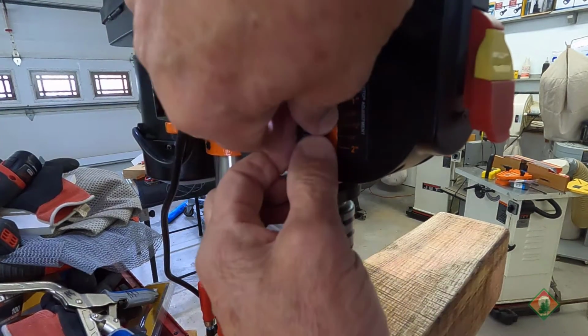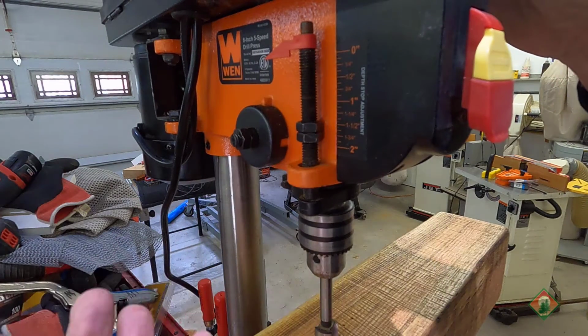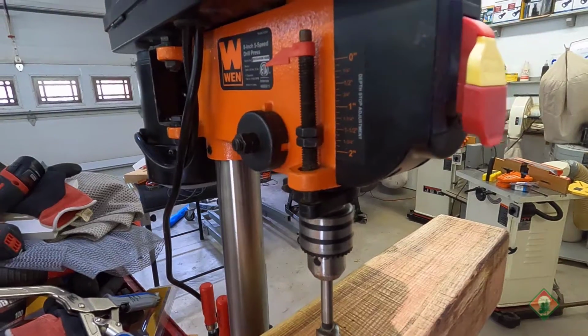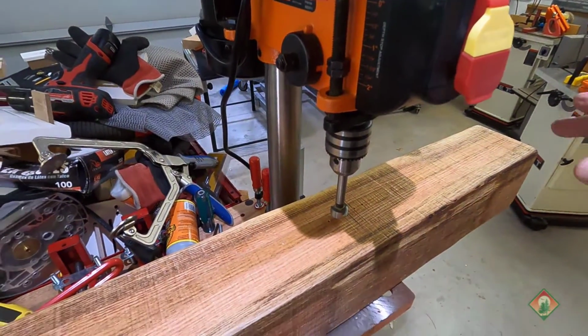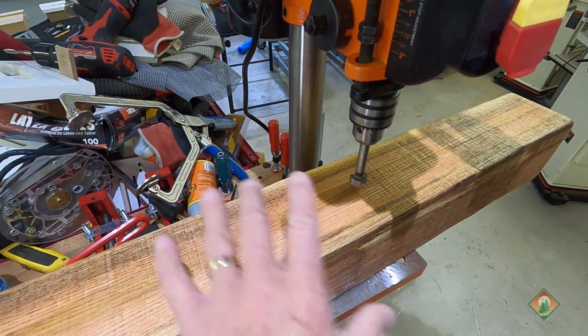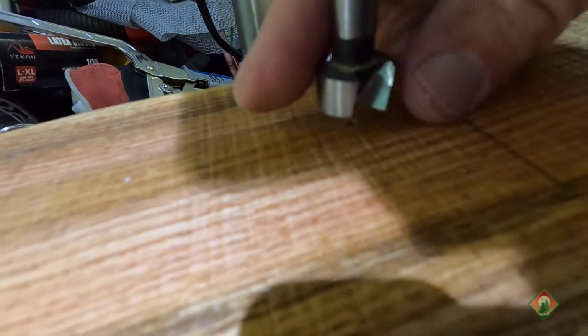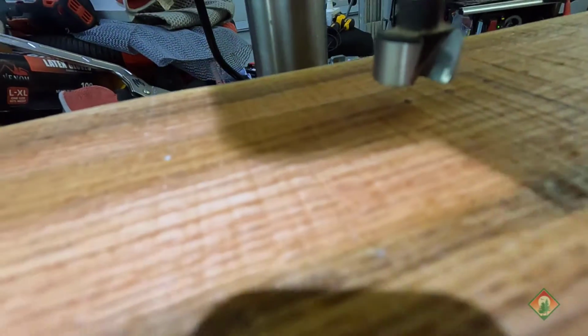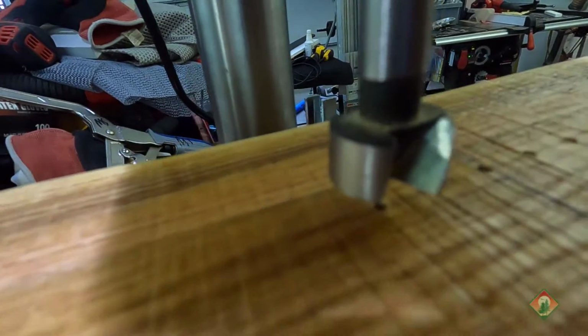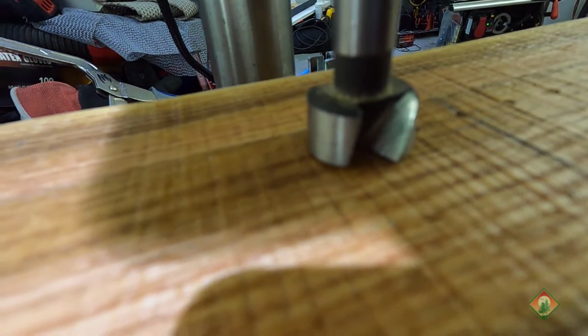Okay, and then you're going to want to have a drill press that does have a stop like that comes in pretty handy. Now, if you don't, it's not the end of the world, but it just keeps more accuracy. So what I'm going to do is I'm kind of doing a little bit of a setup right now. That first pass is a setup, and I'm going to take it. It doesn't make any difference which hole I use, but I'm just going to start with one of the end ones. And basically what's going on is there's a dimple. There's a really sharp point on the end of Forstner bits. It's right in the center there, and then that's what's going to go into that hole that I just made with the hinge bit. Okay, this is all we got to do. And what that does is it prevents the Forstner bit from jumping, because they do like to jump.